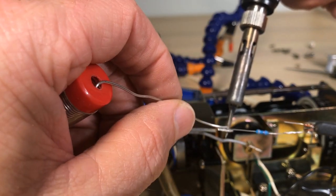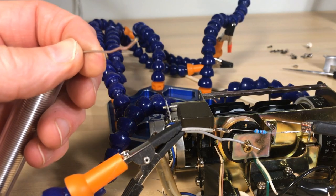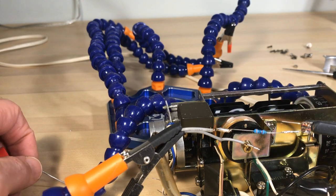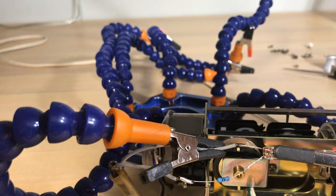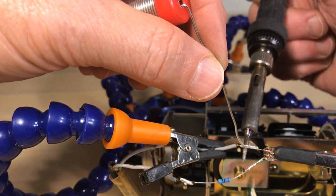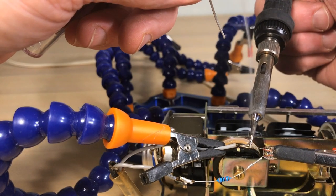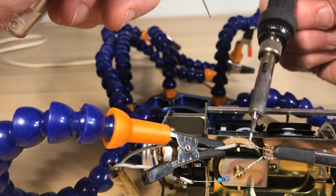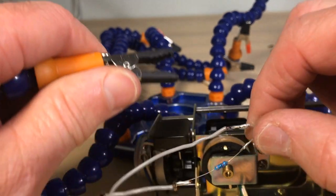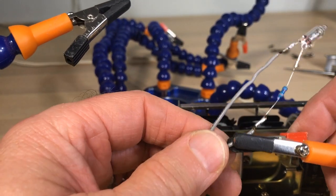You can see the smoking there — that's actually from rosin that's inside the solder. This is a rosin core solder. Rosin is just stuff that helps the metal adhere to each other, and your basic soldering kits are going to have some of that. So the second connection is just the same: get it heated up really well. I cheated a little bit — just touched the soldering iron to get it started and then it just goes right along. You can tell you've got it heated up nicely because it flows really nicely. It takes a little practice. Again, let this cool — don't blow on it. We're going to separate these leads because we're going to power this on. Remember: be careful — this is household current and it can kill you.